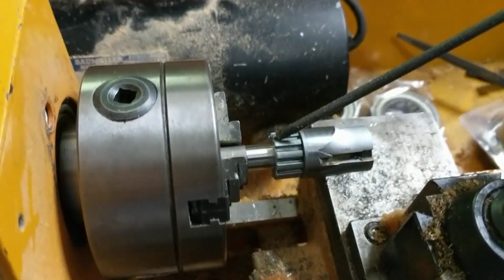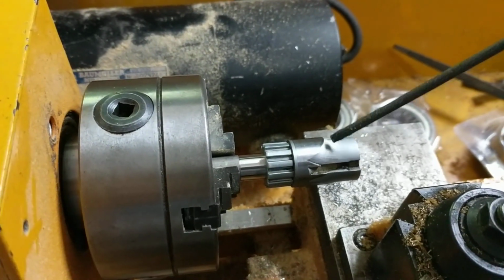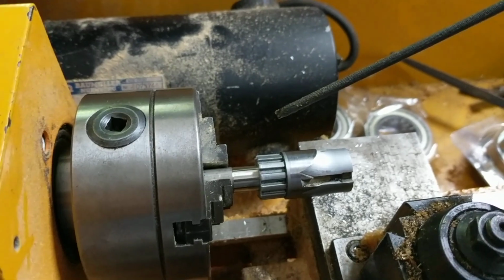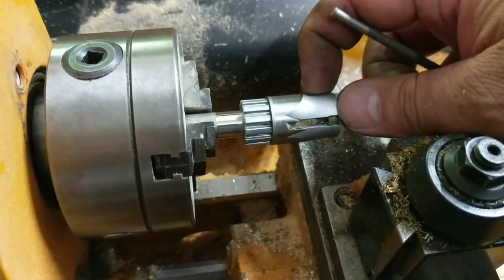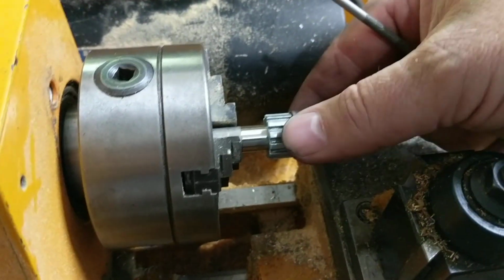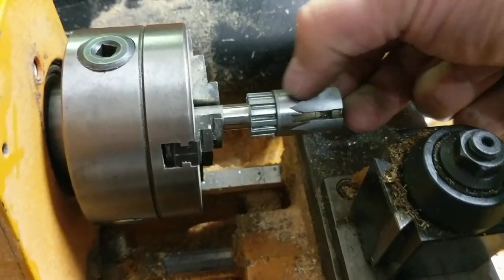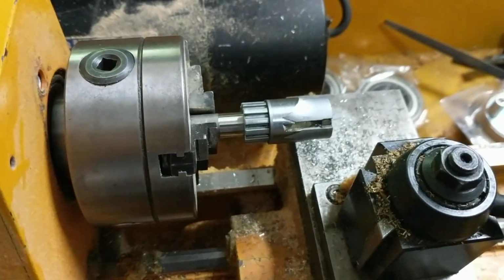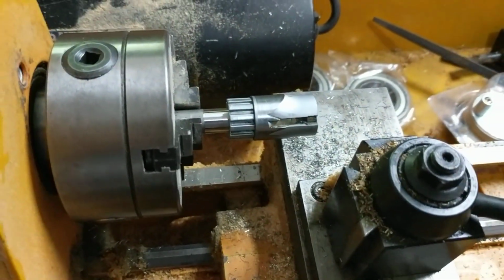So this pot metal must have been casted into this, or injection molded, or whatever they do. This was made up, and then it was put into the injection molding machine, and this was put into it. I don't know if that's what it's called for pot metal. I could still make this work probably. I just have to grind this to length, because this looked like it was still coaxial with everything after I bored that hole. I was figuring I'd be making this smaller and round so that I could then press it into this. But yeah, honestly, to me this looked like the same metal, but obviously it wasn't.